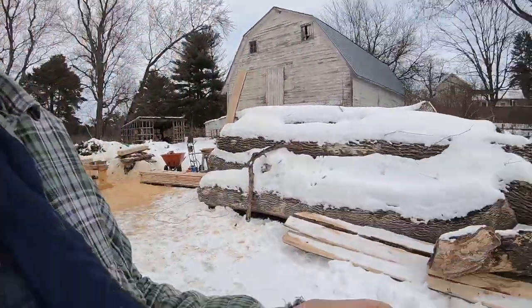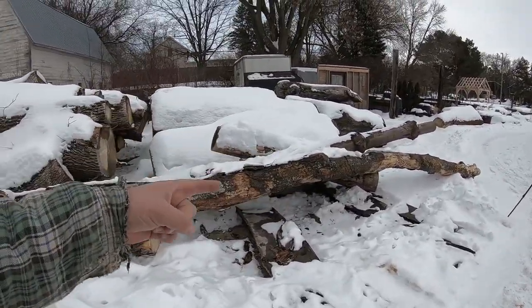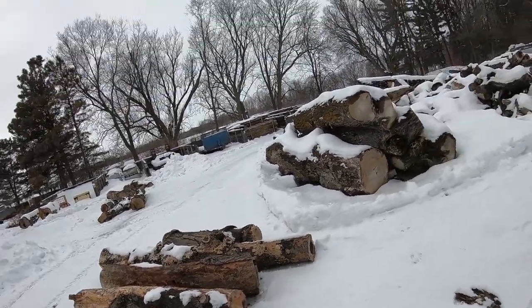All right, the other reason I'm trying to maximize every single board foot out of those boards is, here's what I have left of my white pine. We've got a couple pieces here, and then these smaller pieces here, and I still need to get 160 to 170 board feet of the 1x. We have one more tree. That's probably going to be day 13, maybe 14, with Ben's help getting the other log out of the woods to do the 20-foot 3x5s, and there should be enough wood, but I want to maximize everything here.